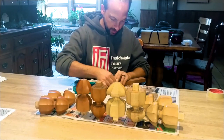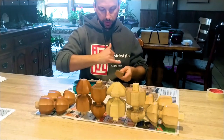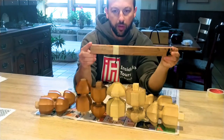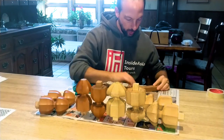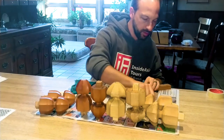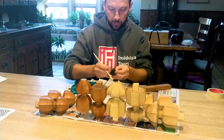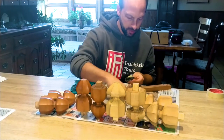It's been sitting around. I'm going to go ahead and tape it off so we can do a before and after. We'll just go ahead and apply linseed to the bottom side and give you an idea of what that's going to look like with just raw dry wood and then wax. Grab a little bit of linseed. This is not a great piece of steel wool.